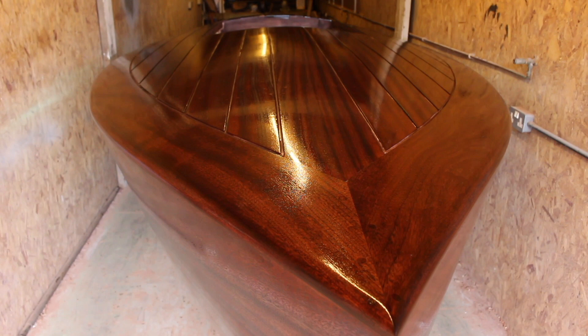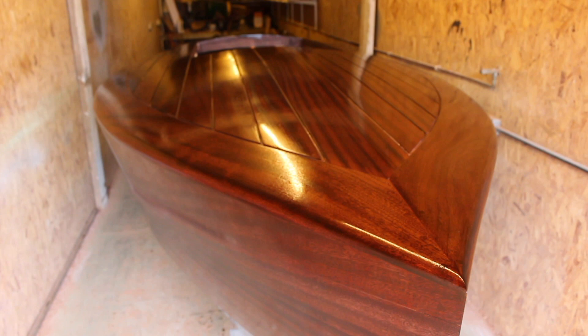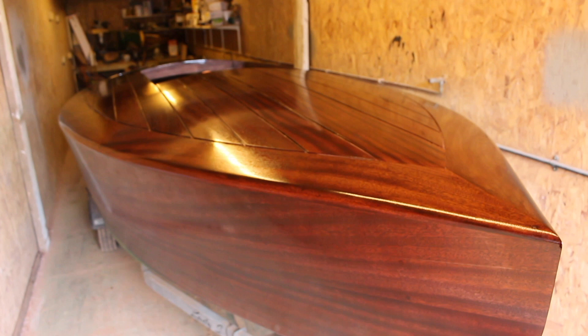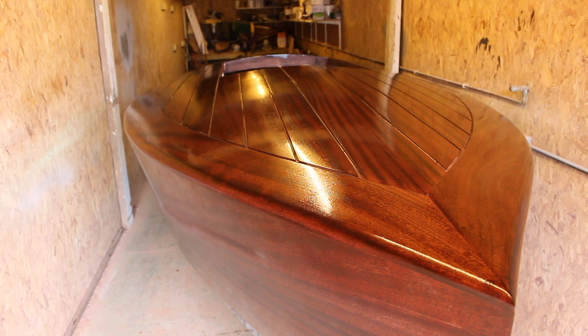Here's the next day after the second coat. The varnish is still a little bit tacky, just a touch, which is ideal — it means I can just get another coat straight on top and build a bit of volume. I'll leave that to harden off, then flat off the boat and start building again. So I'm going ahead with coat number three — pure varnish with no thinners, straight on top.